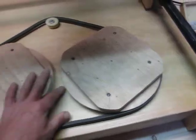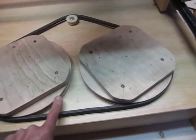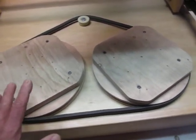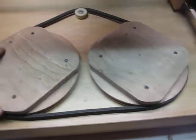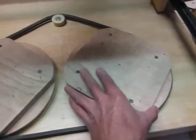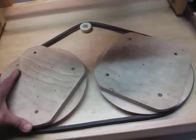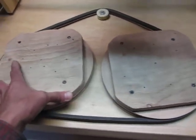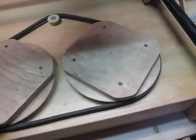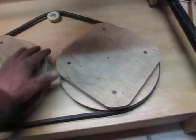If you want this to be absolutely accurate, it would be better to run the belt underneath and use pulleys of the same diameter instead of running on the turntables — otherwise after five or six turns you'll notice the tables are not aligned properly. However, for what I'm planning to do I might only turn half a turn one way and half a turn the other way, so they will stay accurate.